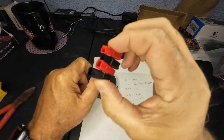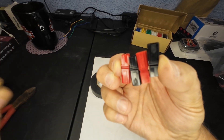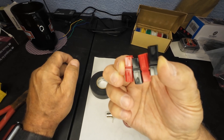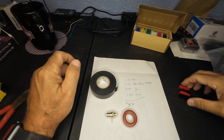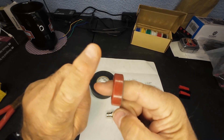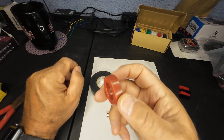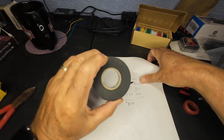We're going to use PowerPoles — these will be used for my wire to go for the antenna as well as for the counterpoise. If I wish to use a counterpoise, I can put these on there. There's not a built-in choke to this one, so your coax will become your counterpoise. Just go ahead and put a choke right before the transmitter, that way I can use the coax as a counterpoise. We're going to use a core — the links to all this stuff will be in the description below — you can simply click the link and purchase all this gear.